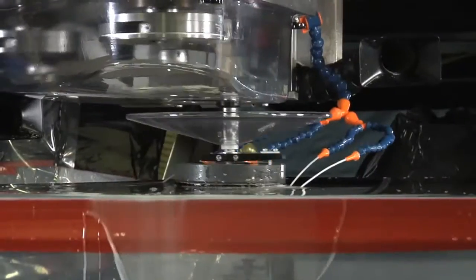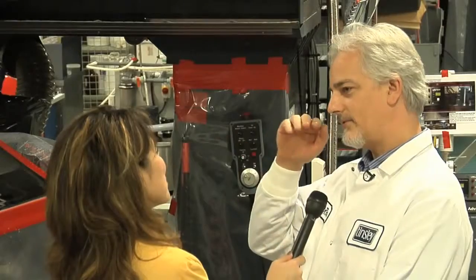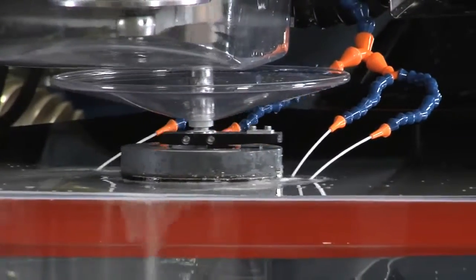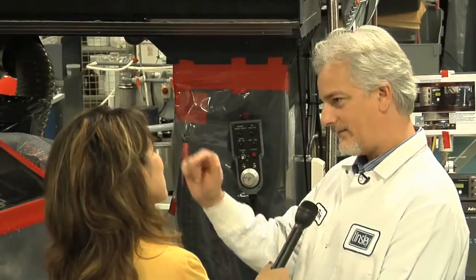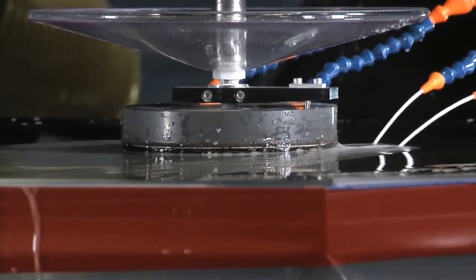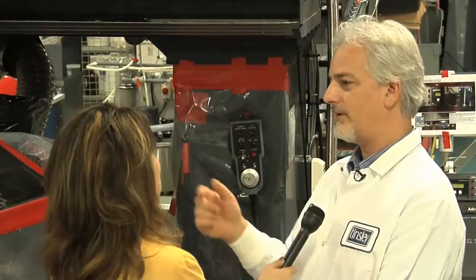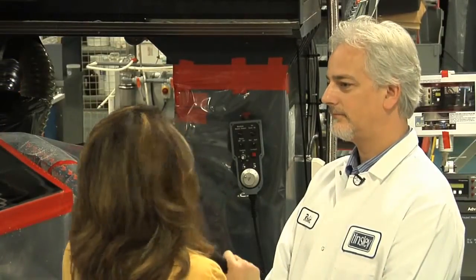Well, the mirror surface, when it comes to this process, has a texturing on it. And so this process will take the little peaks, saw it off, until finally you have this perfect plane. And these are not flat mirrors, but you want that surface to be just very continuous. If it has roughness in it, it won't perform well because each little lump and bump on the surface reflects light in a different direction, and so it doesn't come back to the detectors. So this process helps it to be extremely uniform, so you have the maximum amount of surface area returning the light for you. Well, thanks a lot for showing us this.